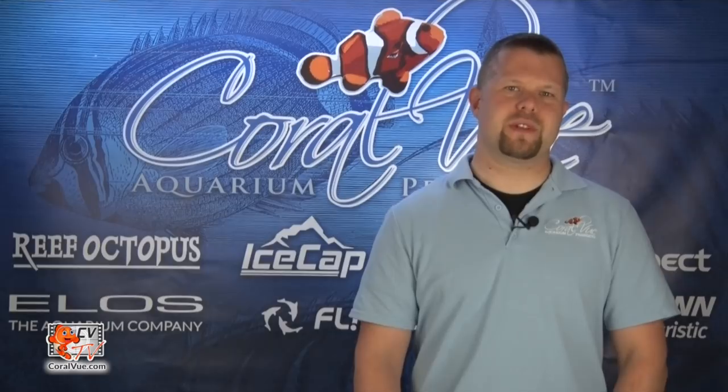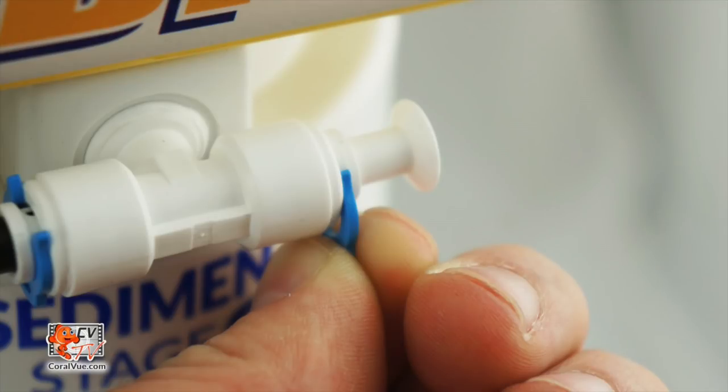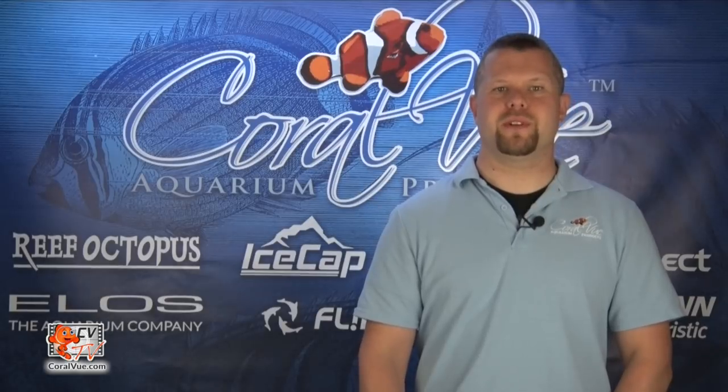The vast majority of the system's connections consist of quick connect fittings. To separate an inserted tube from the fitting, pull the blue retainer tab out and push the collet in while pulling the tube away from the fitting. Installing the tube into the fitting could not be easier — simply push the RO line firmly into the fitting and reinsert the retainer.